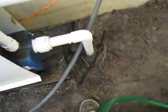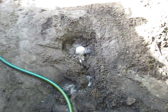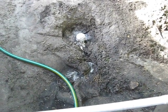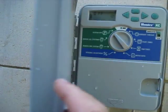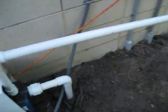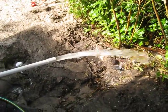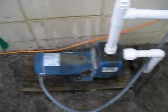The pump is plumbed underground to the well which is over here. There's a T on there that connects up to the pump on top. You see a cap that unscrews — a plug — so we can put water in there if we need to prime it, or if we need to put acid down there later to treat it. We put some time on the clock just to turn it on. The pump's running and I've got a pipe sticking out temporarily just to channel the water off to the side. This is the water we're getting now out of the well.